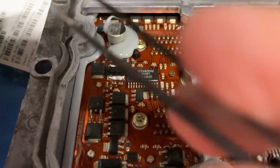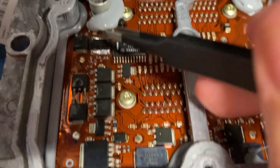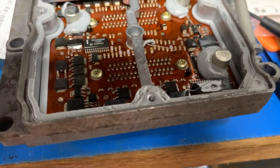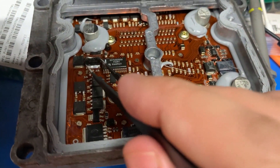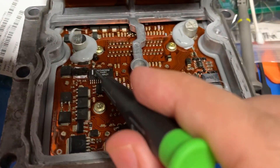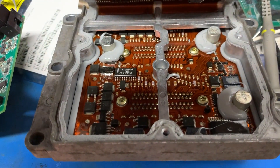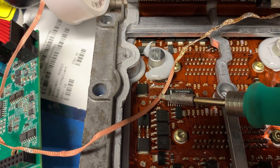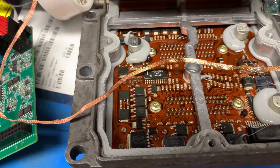You can see I've gone ahead and cleaned off the conformal coating and wetted these solder pads to help with thermal conductivity for removing the chip. I've set up my air gun pretty aggressively — it's a bit hot actually, but it's necessary for this board. Basically what I'm going to do is heat this up, then don't pull very hard, but get either a small flathead in there and give it little taps until it's ready to come out. Here's the basic idea — you heat it up and that's essentially it, and we'll keep doing that until the chip is free.